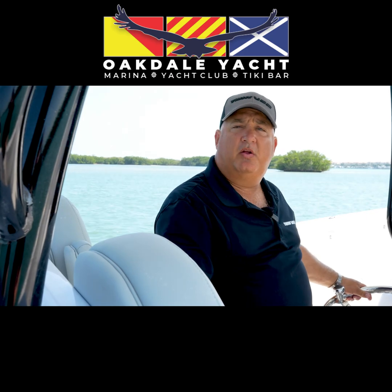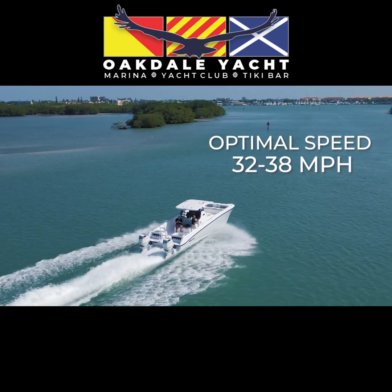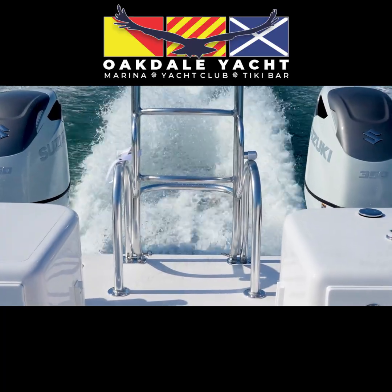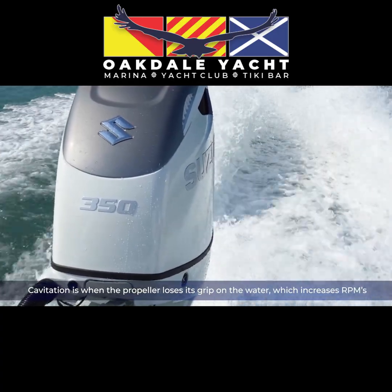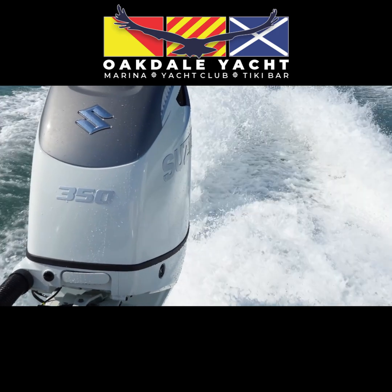So the optimal speed on this particular hull, the Twin V 340 GFX, is somewhere between 32 and 38 miles an hour. Also, while operating at this range, you want to have your trim setting as high as possible. Trim this boat all the way up until the motors almost cavitate. And then slightly trim them back down till you hear the cavitation go away.